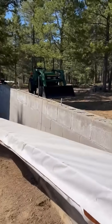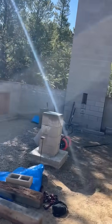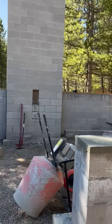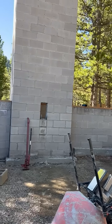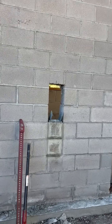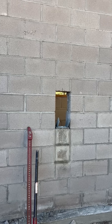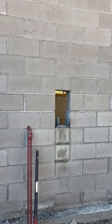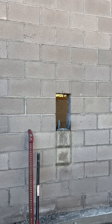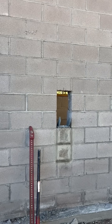We're getting there. I got my footings set last night and poured. And it dawned on me that it would have been better not to set this anchor plate down here until the very end. It makes it more difficult, but I've got it all lined up with the strings and levels. I think it would have been smarter to just set the block and then set the plate at the last minute, fill the cavity and put everything in there.